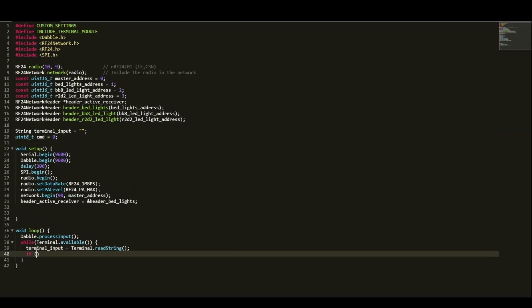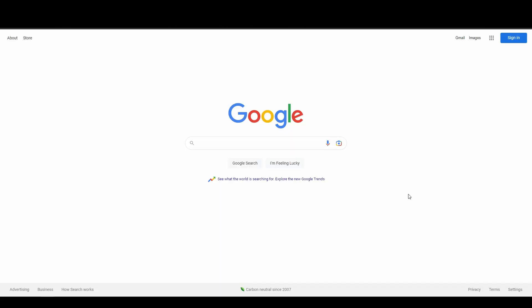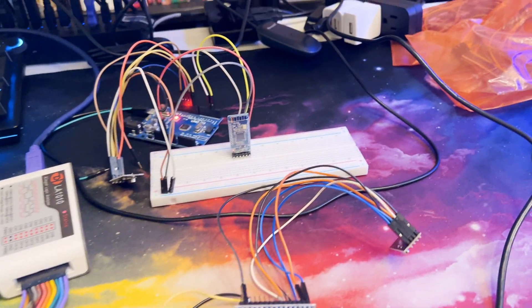Step three is to write all of the magical code that makes it work perfectly first try. The code is really cool and all, but explaining it is really boring, so the code will be on GitHub for the millions of people who will inevitably want this. Basically, there are some really nice software libraries for the NRF radio and the HM10 that I utilize to make sending and receiving data really straightforward. I did have to write my own NEC IR protocol data sending functions that would allow the Arduino to imitate the IR receiver interacting with the light's ROM chip, which was hard.